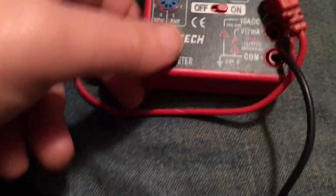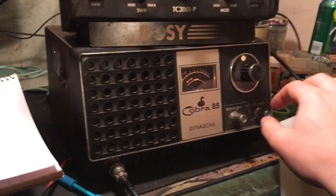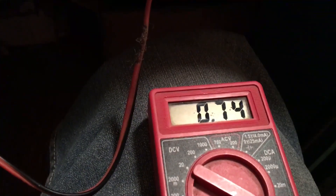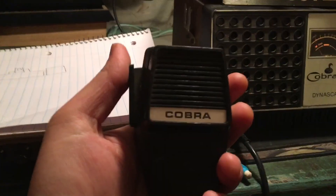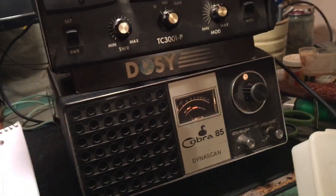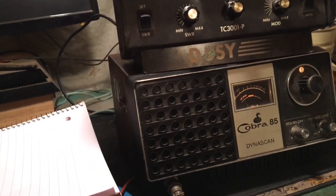You'll want to use your multimeter. You'll have one common port and two other ports. This one is for 10 amps DC — we have it on the 10-amp setting. Right now it's showing 0.25 amps. If we turn the volume up — headphone warning — it's drawing about 0.75 amps or so on maximum receive. If we transmit, which is what we care about most, key your microphone and get maximum modulation by whistling or blowing into the microphone, and watch how many amps you're using.